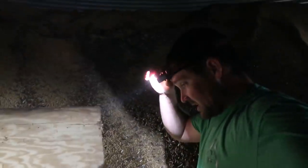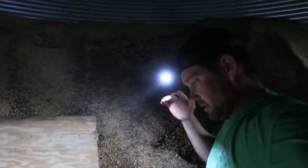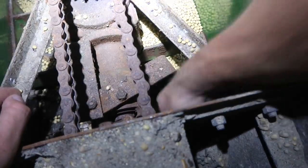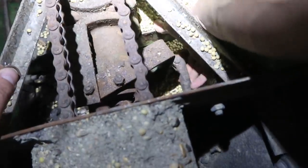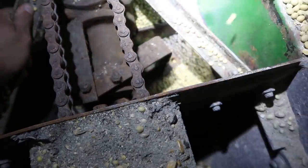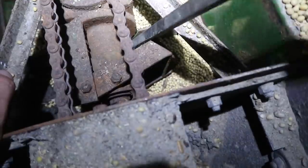I can pretty well say at this point that the dealie boppers are spinning even when the dealio isn't lined up, but the thingamajig must be catching on the husker donut. I actually think this shaft that comes in right here — I'd call it the shifting rod that connects the sweep — it's just on a pin here. If I can eliminate this rod, I'll know if the gearbox is working and maybe it's this rod that's hung up. Well, I got it disconnected and it does move fine. So then maybe it is in this — I'm finding some progress here.